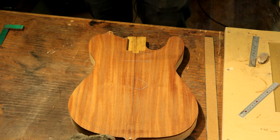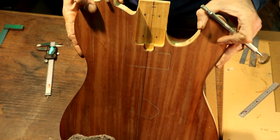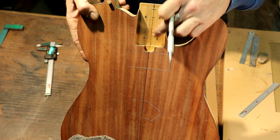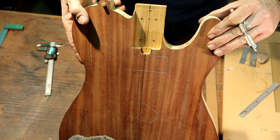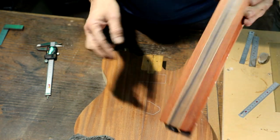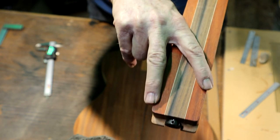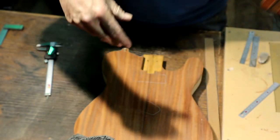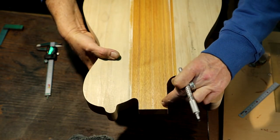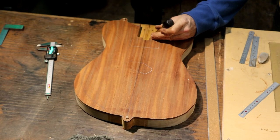There are our two top side holes — we know we want to be 13 millimeters. Those four dots, here, here, here, and here. They're a little bit closer to the center line than you'd normally see on a bolt-on neck. What that's going to allow is for my threaded metal inserts to not be too close to the outside edge of this neck, which can cause blowout issues. Also, when I go to shape the back of this body, I don't want those recesses too close to the edge of the back of my neck pocket. Let's get these punched in.